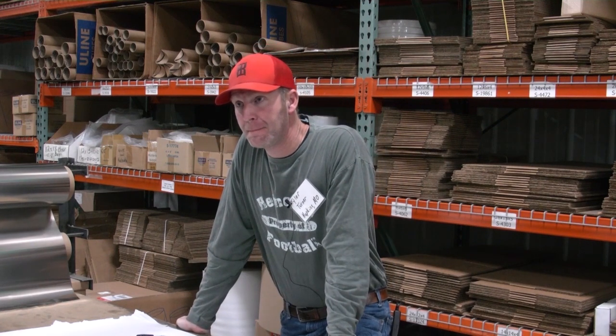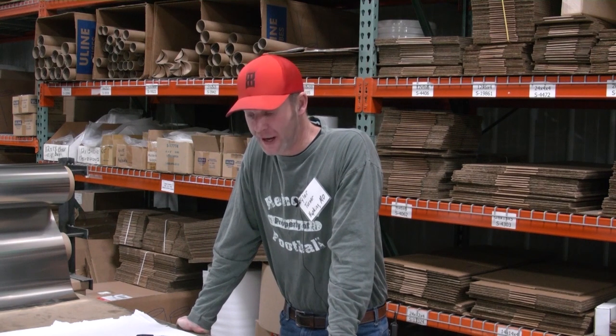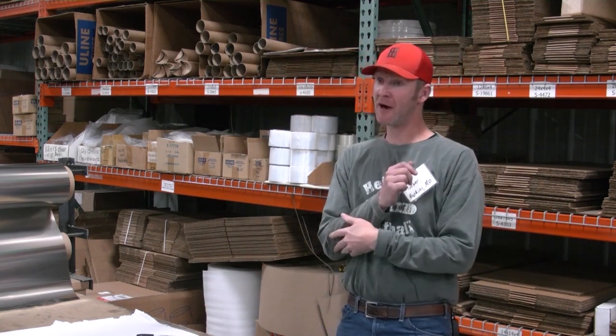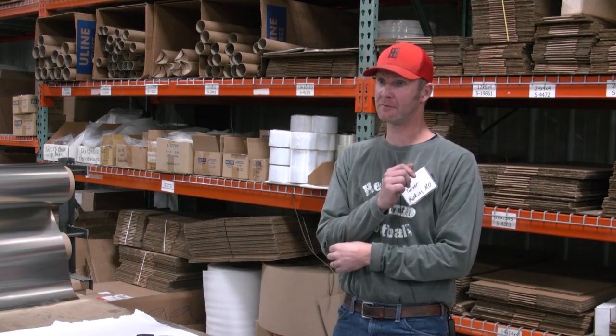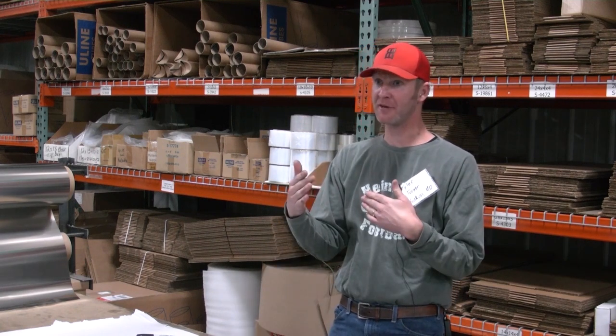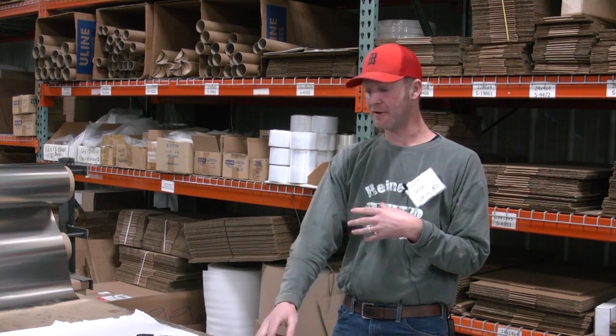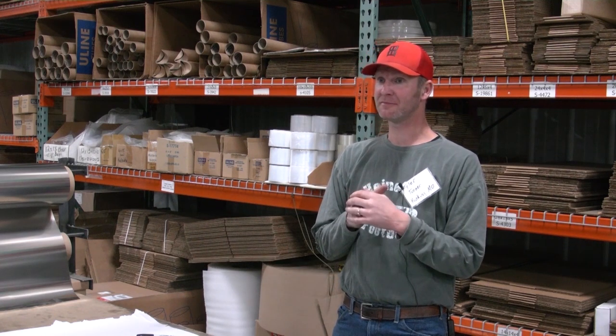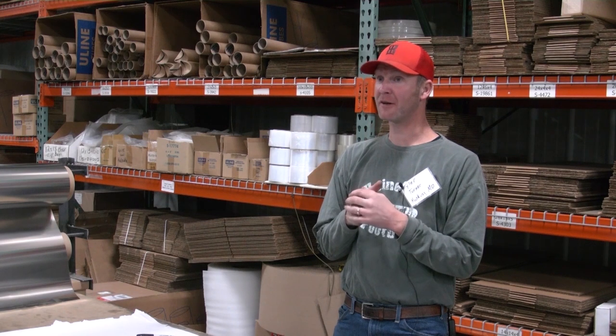How thick a titanium would you use? I use 70 thou. Whenever I go to build a liner lock, I use 70 thou all the time. Generally, for the most part, I never have to relieve the lock when I use 70 thou, just because of my lock bar length and everything. If I do, it isn't much. On a liner lock you're dropping it down to 50 thou, basically. On the frame lock, yep.